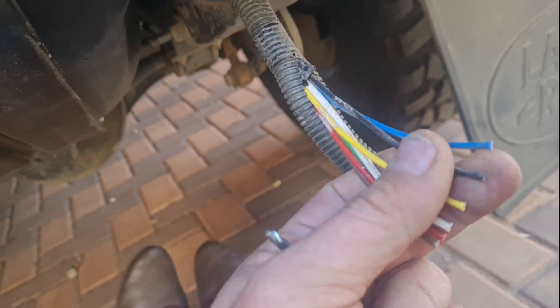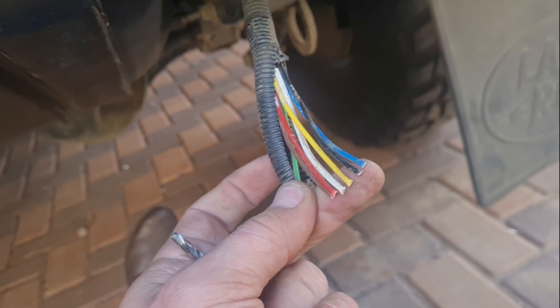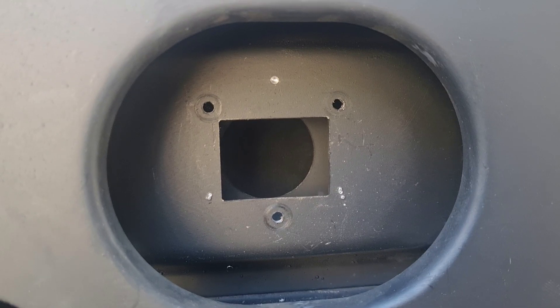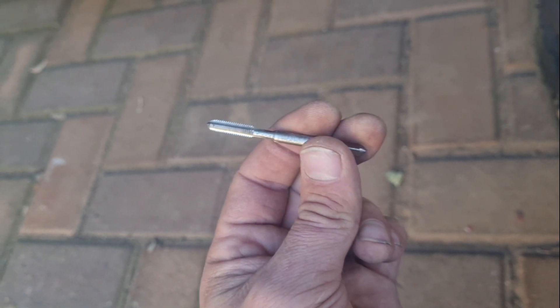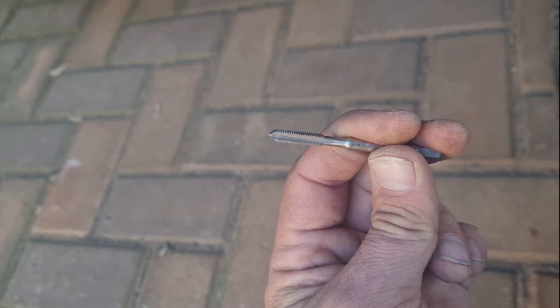While I'm busy with this whole exercise here I'm going to put the plug on this side. I've cut the wires off because I got connection blocks - I can't get to the plug at the bottom to unplug it, so I'm just going to reconnect that. The idea is to mount it there with a 5mm screw, so I need to tap it with a 4mm hole. I've got my 3 holes and I'm going to tap it now. This is an M5 tap but it requires a 4.2mm hole - I made a 4mm hole because of the thin material just to get a tighter fit.